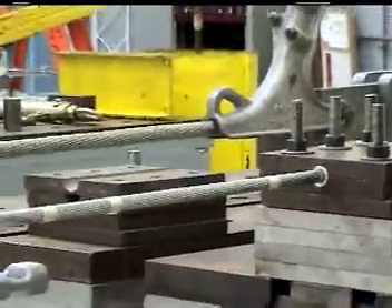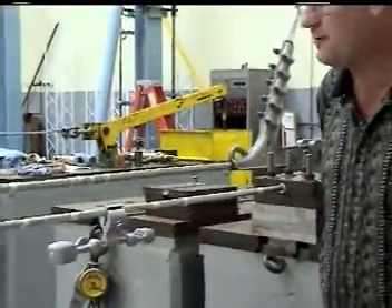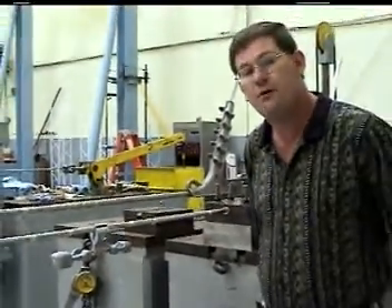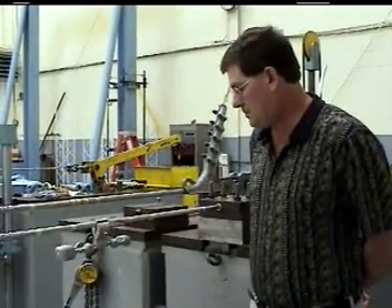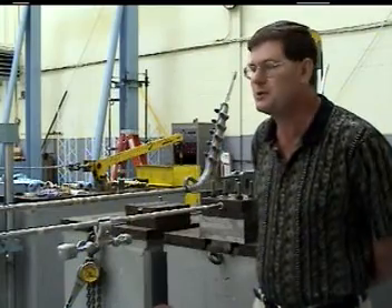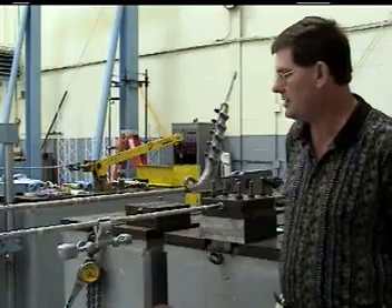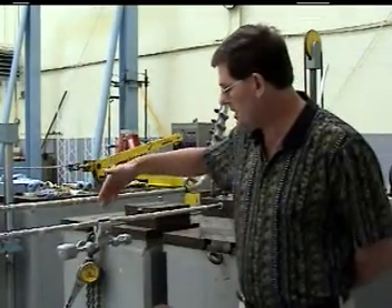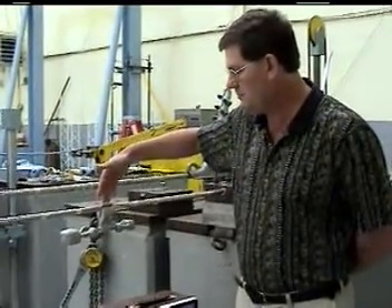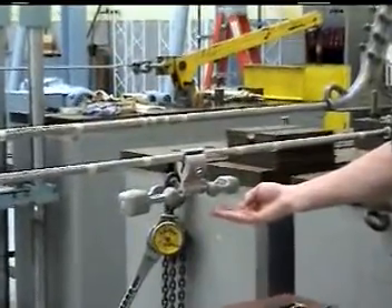In this particular test, you can see we're vibrating the cable at approximately 45 hertz. That is one of the resonant conditions that would correspond to about a 4 meter per second wind speed for this 18-millimeter ACSR conductor. As you can see, we have the damper moving — you can see some displacement of the weights, and that's indicating the damper is functioning. At this particular frequency, we actually have both weights moving.